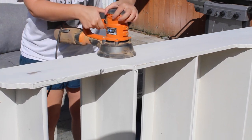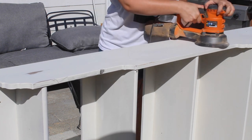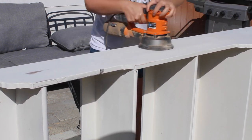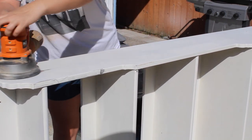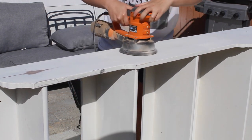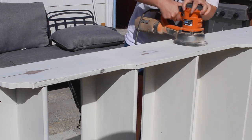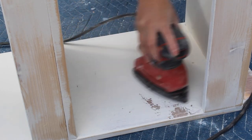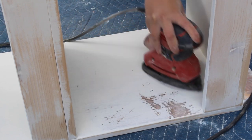So this had been painted a while back with just some white chalk paint. It was never sealed with anything, so I'm not really worried about getting all of the paint off. I'm using my random orbital sander and just trying to sand out any drips or runs — there's quite a bit of brush strokes on there. I just get it all nice and smooth as well as try to sand out any scratches or dings. There were quite a few on this. And then I did switch over to my little mouse sander to get on the inside sides to smooth all that out as well.